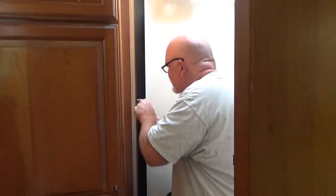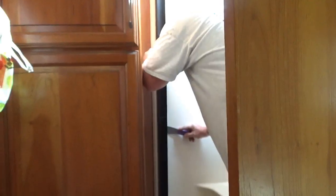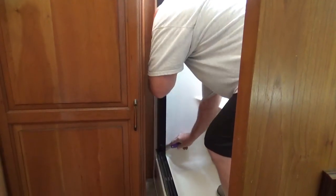I've got to get in here and cut down the sides where there's silicone — cut all that loose. I already caulked it once because they had caulk down here and it stops right there. That's where it was leaking — back in here. Why didn't you just put caulk down there? Because that's temporary. You've got to get caulk underneath this track to where it makes a good seal. I have to take off these sides first to get that bottom track out.